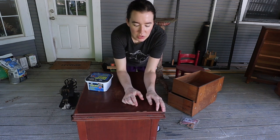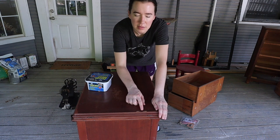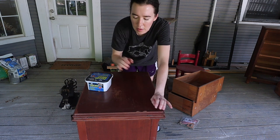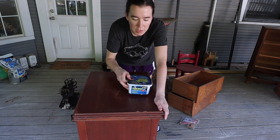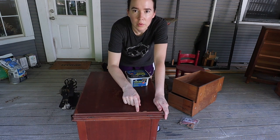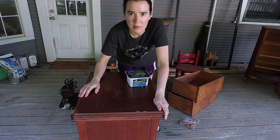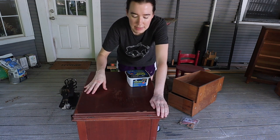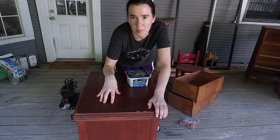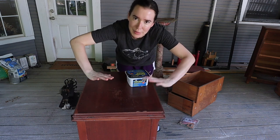It's a new day — ready to restore this thing. The top is in pretty good condition and you can see all the sides as well. There are just a couple of parts where the veneer has come off on this side and on the back as well. So what I'm going to do is fill this with wood filler, wait for it to dry, probably sand the whole top down so we have a nice even surface, and then I will stain and eventually seal. I'll probably have several coats of poly on top because it's going to have a sink on it, it's going to get wet, and I want it to be protected.